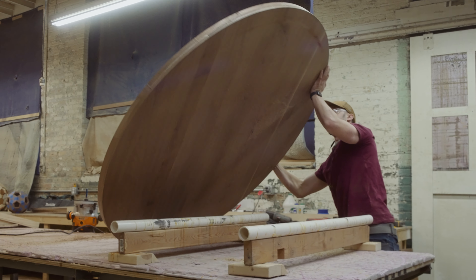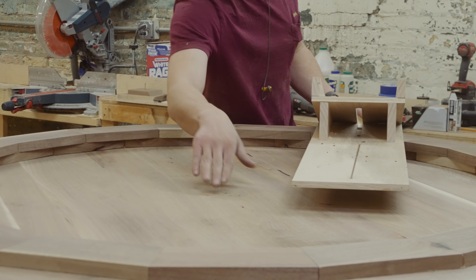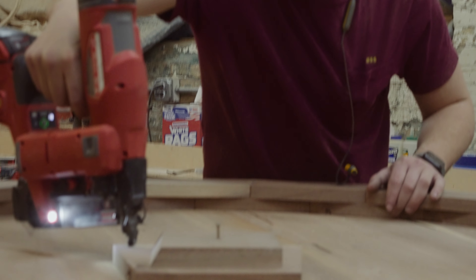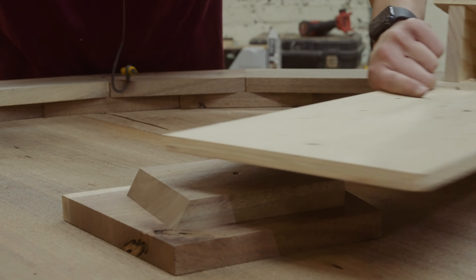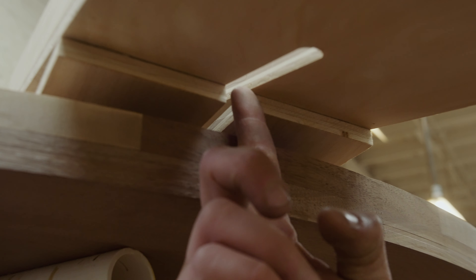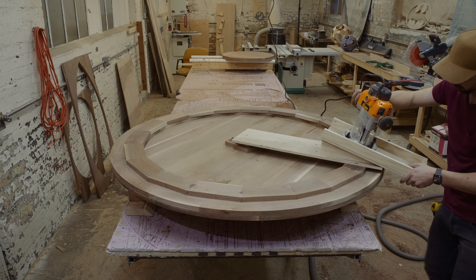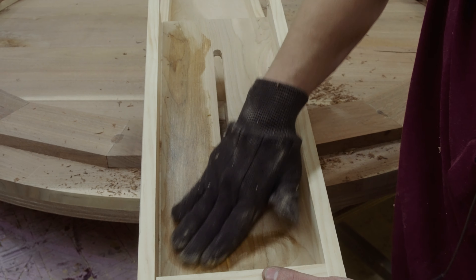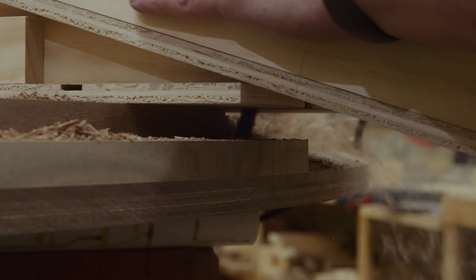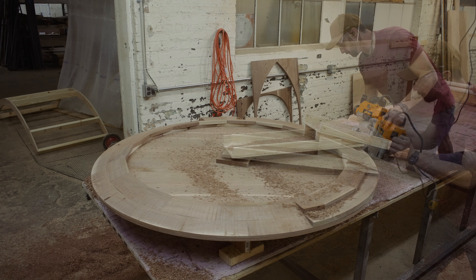After giving the new router jig a quick test, it was time to remove some excess material from the first layer of the dining room table. I then flipped the table over on the back side for easier access to make the bevel detail around the edge. I attached a temporary piece of walnut to the center so I had something for the circle cutting jig to pivot around. Once in place, I started off slow, taking off less than needed on the first pass, then made my way around the table — it took over an hour and was super messy.